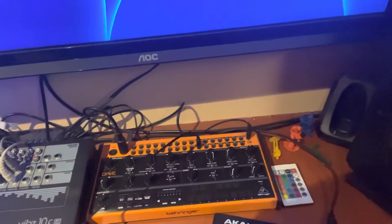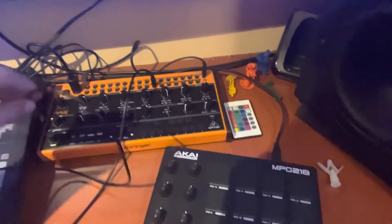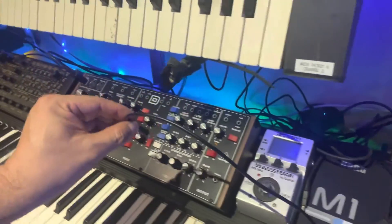Before this video ends, I just wanted to address the most common question people could have: what kind of cable did you use? What I used was a mono 3.5 millimeter plug cable — these are used for synthesizers to tap into specific functionality or communicate with other synthesizers. Although this may look similar to something you may have around the house, it isn't, because this is a mono cable. The one you may have is a stereo plug, which has tip, ring, and sleeve.